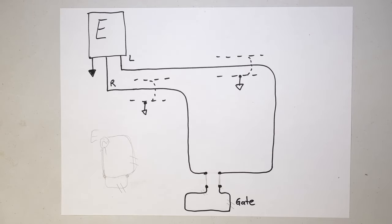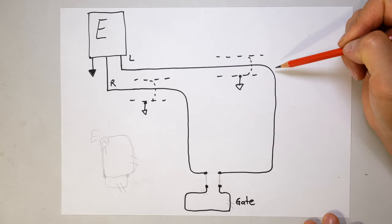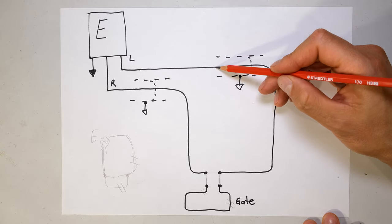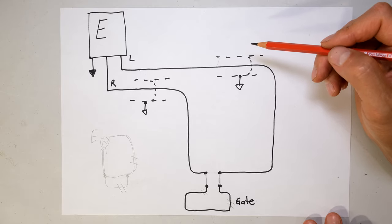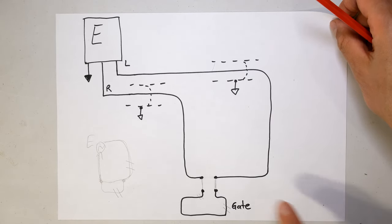You don't have to do it like this - I'm just giving you one option. If you're wondering what this is, this is your earth. Remember that the earth wires are always running nearby your live wires so that if somebody moves the live wire and it touches the earth, you'll also get an alarm activation. The next question is how do you wire this? In principle, this is easy, but now I'm going to show you the wiring layout.